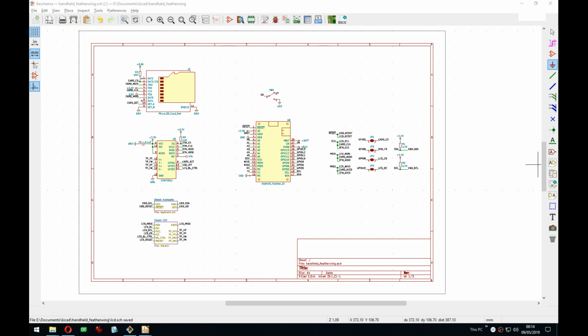On the front, we have the display, which we can control over SPI. It has a touch that's actually connected to the touch controller. Reset is connected to the global reset, and then the backlight is over that expander, and the backlight is on by default. Correct. Under the display, you have the 2 buttons and the joystick and the keyboard, and then the keyboard is I2C. Yes, there are pull-ups on it. Yes, the interrupt is actually connected to the expander. The reset is also on the main reset. And then internally, the backlight is over the I2C. Correct.